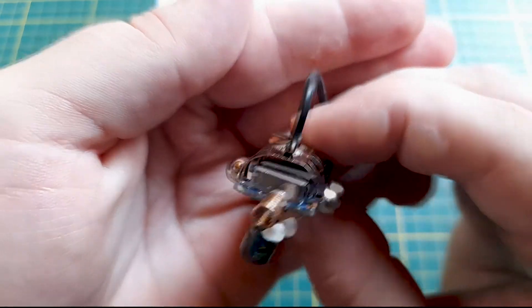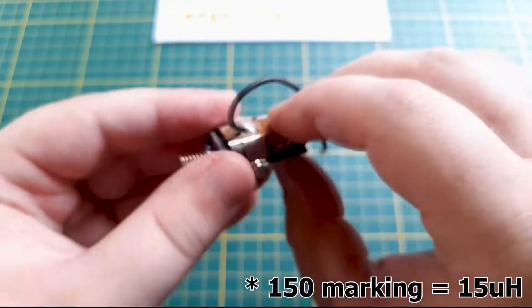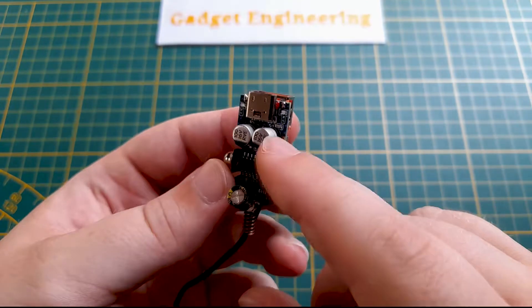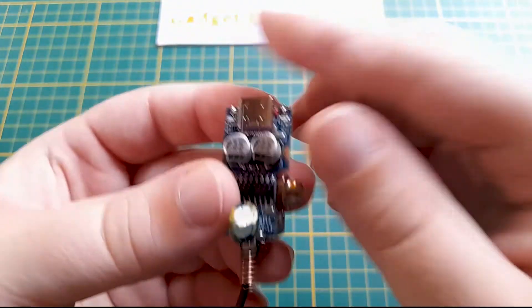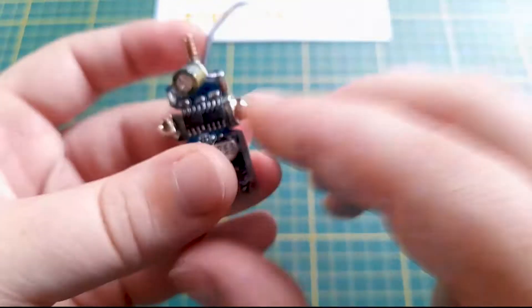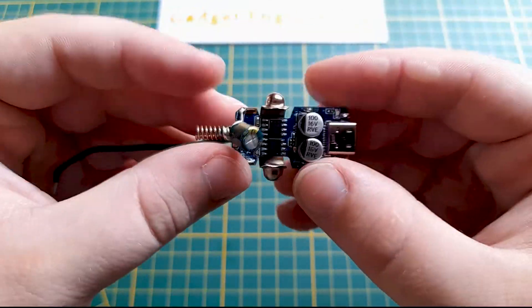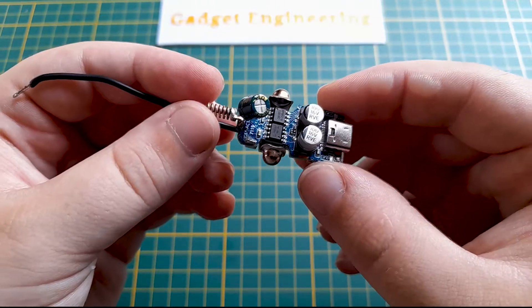Under the ground shield — to which I've just tacked on a wire to connect it easier to the lab power supply — we have our two inductors. We can see two surface-mount 150 micro-Henry inductors that will be powering this whole thing. The two chips are set up as two separate devices: one chip powers the USB-C, the other bucks the voltage for the USB-A. It's a quite sturdy little package, very compact. Heat could become an issue at the high wattages; it's rated at 42 watts, which should be plenty in this little package.